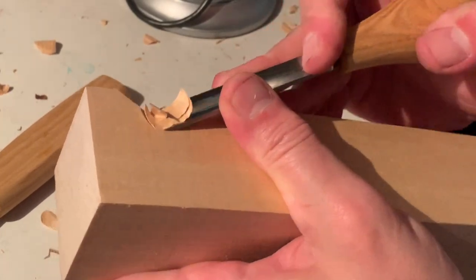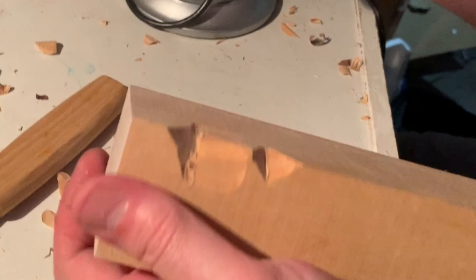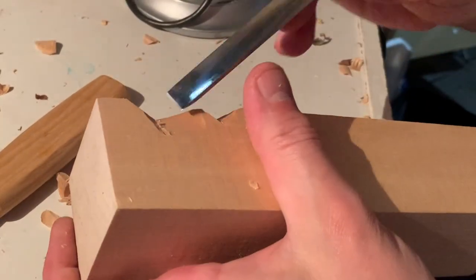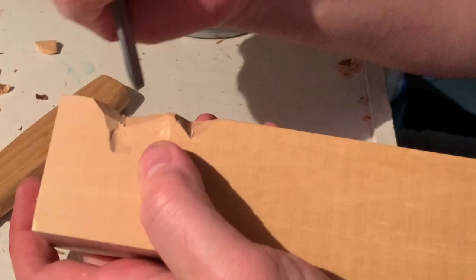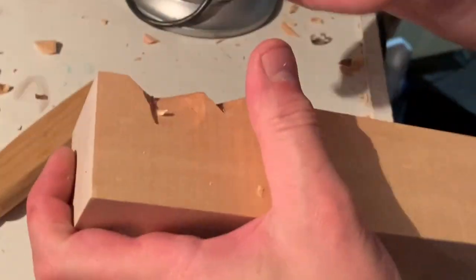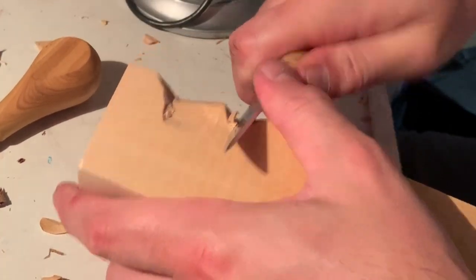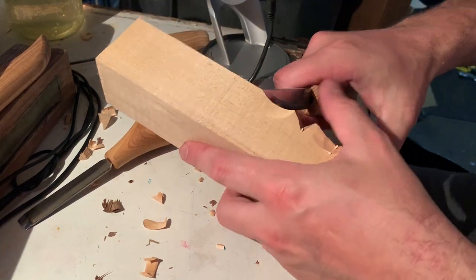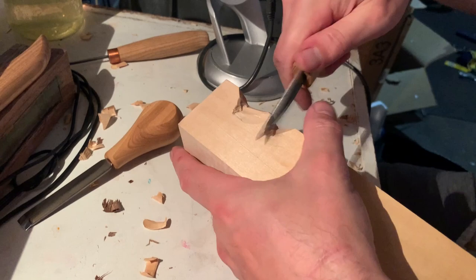It's tricky to get quality steel because that's where most of them skimp on money. There's tool steel — O1, 1095 — there's not many of them. If you use quality steel you could shape the tool any way you wanted, and as long as it was heat treated properly you could shape it to something you wanted. People say, 'Oh this tool sucks but if I sharpen it up and shape it, it'll be okay' — no it won't. Carving happens on a tiny, invisible-to-the-human-eye molecular level. That's how cutting works.